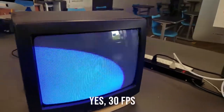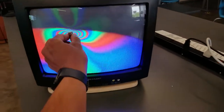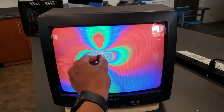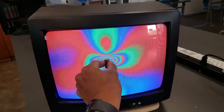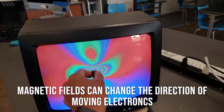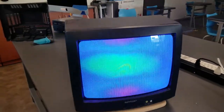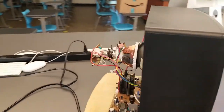It's about 30 frames a second from my video. But what I can do is put a magnet in front of the screen, and what I get is a pattern created because of the magnetic field — the static magnetic field that redirects the moving charged particles. So what moving charged particles do is they move in the presence of a magnetic field. Televisions were essentially particle accelerators that we sat at the business end of for much of the 20th century. Same thing for old computer monitors that had the big back too.